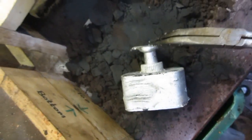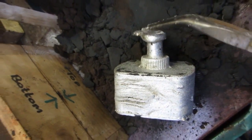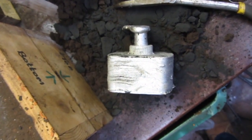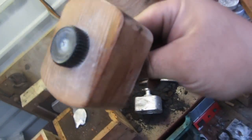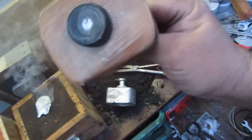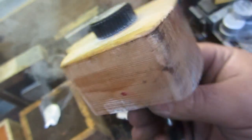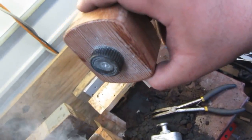Once I cut this piece off, leaving the pattern piece in place — you see that piece there that's got like a pattern going across it — that stays. That would be the front locating peg for this gearbox to locate onto wherever it's going. In this case it's going onto a Unimat SL lathe. So this was my original pattern — just a piece of wood shaped to the shape of a motor, and that's a bottle cap which is screwed on, which is the right size for the piece that sticks out of the electric motor to locate into the mounting plate of the lathe. Then there'll be two screws there and there to keep the motor gearbox and motor attached to the lathe.